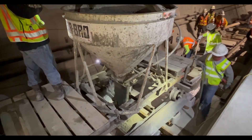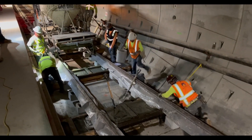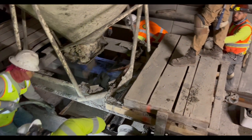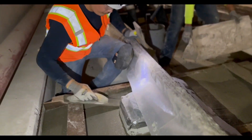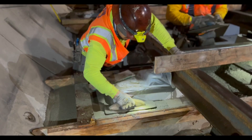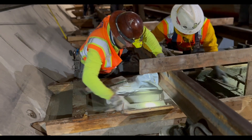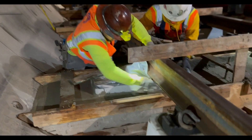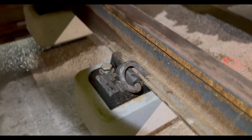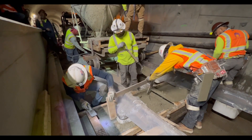With this system we're pouring cow pies, so we're locking in two blocks every 10 feet, and that allows us to pour out about 400 to 500 feet in one shift. With DF track you would never get those types of productions. Once we get the two ties locked in we can run whatever high rail equipment we want over it, and then when we come back and do the infill we're going to be looking at probably pouring 600 to 700 feet a shift with that operation.